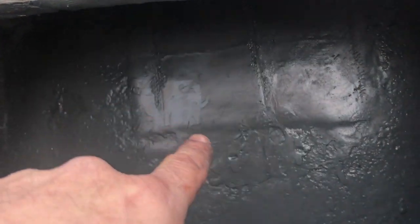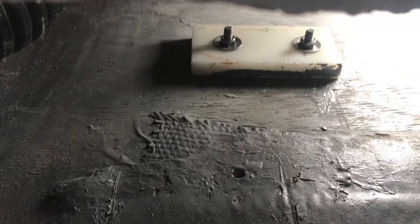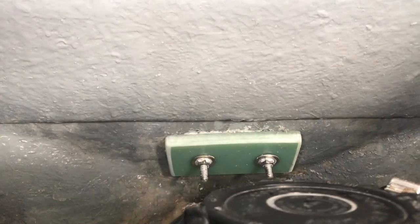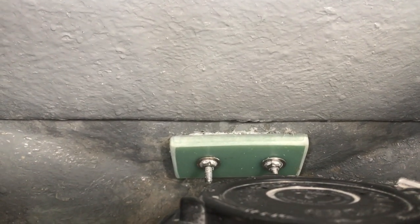On the inside I painted with some bilge paint and you can see where I laid in some new fiberglass. For the very top gudgeon, this is actually an original backing block made of high-density polyethylene, or Starboard. There's obviously wood core in there, so I'm wondering if that's even necessary. But for the middle gudgeon, where there is no wood core, I did add this half-inch G10 board backing block - it's pretty substantial. And of course sealed it with 4200.